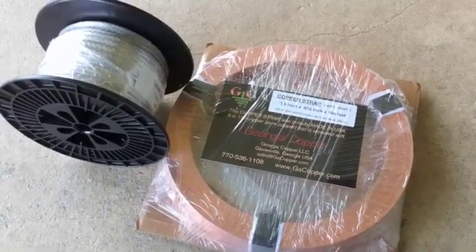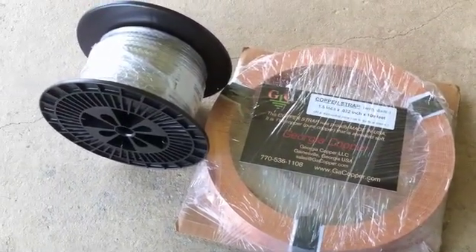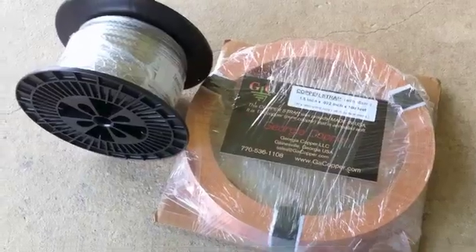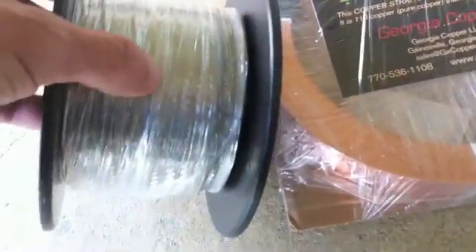I'm back — I always seem to review my video real quick and see something I mentioned and never followed up on. I had said the different sizes of grounding used. Outside we'll be using the inch and a half from ground rod to ground rod in the ground, and I had mentioned using a smaller diameter inside the shack and I wanted to cover why.